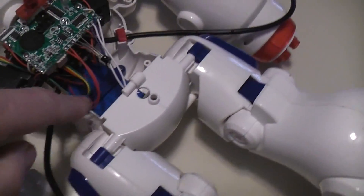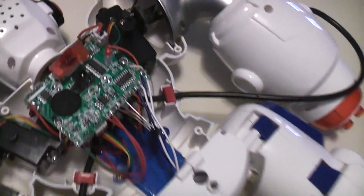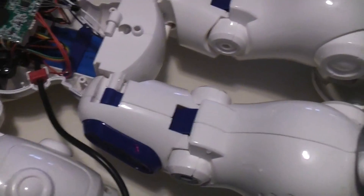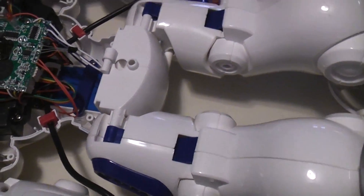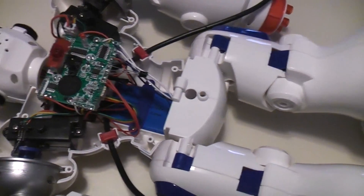In here, the blue thing that you see down in there is held in with two more screws and coming up to this battery connector right here — that would be the 3.7 volt battery at 700 milliamps or whatever they said in the manual. At some point in the future if the battery should go bad, you could remove the back, unplug the battery and put another battery pack in there. And if the battery pack had a different connector, you could splice these wires on and use this same connector.